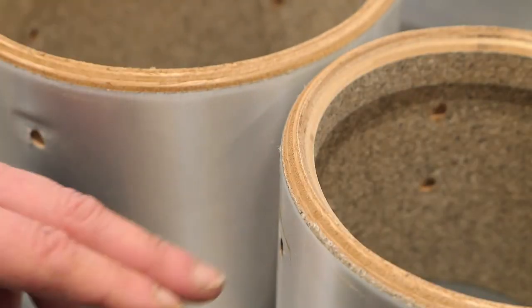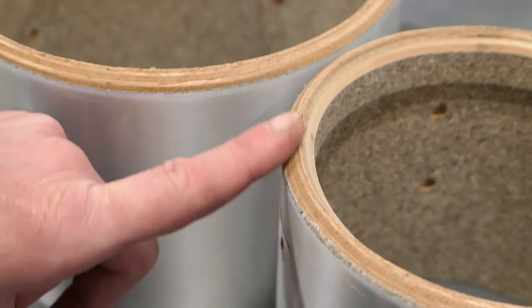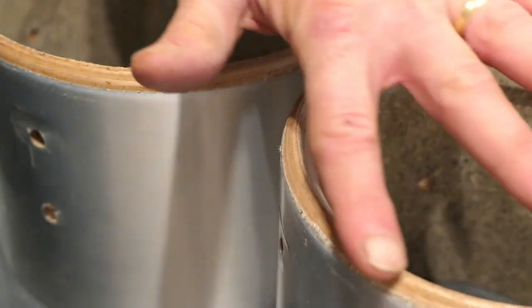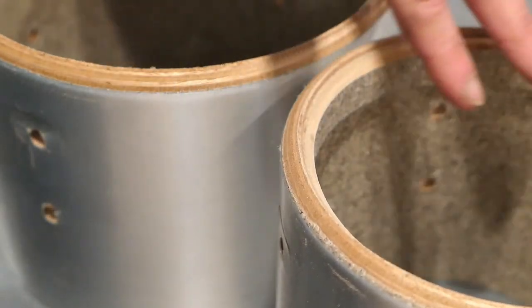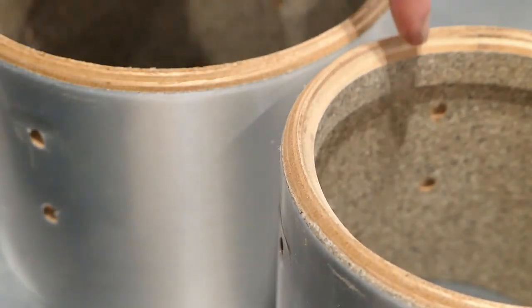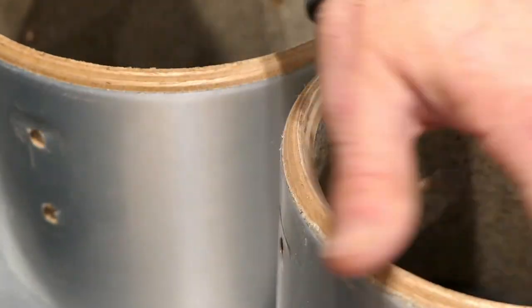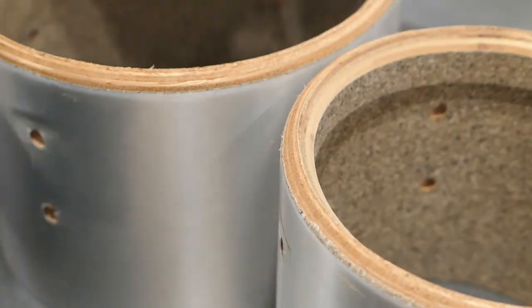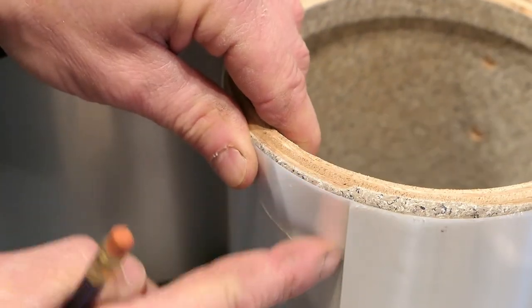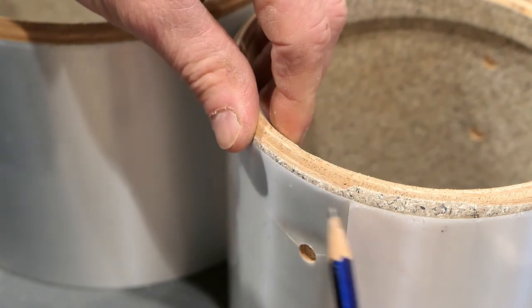Right off the router table — pretty good, I don't really have any complaints. This is essentially plywood, so you're routing plywood and you can expect some fuzziness, which I will clean up with sandpaper by hand. As far as the bearing edge though, it's nice and sharp here. So when I clean this up, it's going to be good. I think I'll try to paint this — I'm not going to match the internal coating they did originally perfectly, but some paint will help consolidate things. After I paint it and let it dry, I may do a very light sanding over the paint just to make it nice and smooth. As far as that bump area — here it is right here — that's because of this little seam. Not a big deal; just this little section has to be done by hand, and I can easily accomplish that with sandpaper.